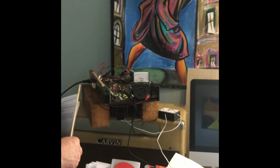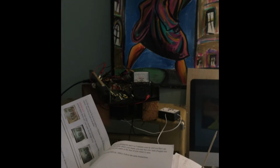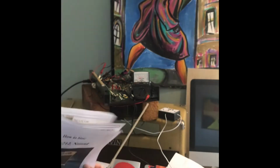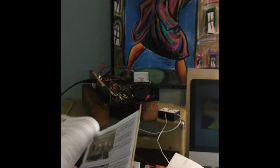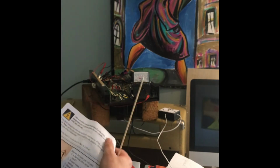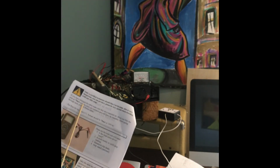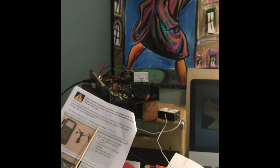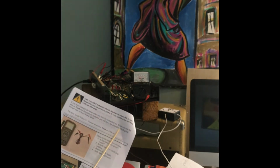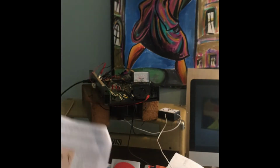Now, in here they say, and I can't find it now unfortunately, but I've read this before, they say if you adjust it to 75 milliamps across the standby switch, that'll result in the, oh here it is. When you've changed the tubes, make sure they are a match set. This isn't. When you bias the amp at 75 milliamps across standby and the tubes are matched, you will have the desirable 20 milliamps going through each tube of the 4 power tubes. Now 4 times 20 is 80. How do you get 80 if you're only letting 75 milliamps go through the standby? That I don't understand.